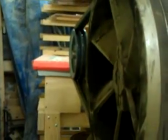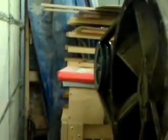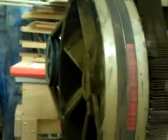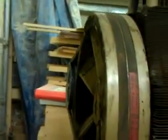And the pitch on the B section there is 6.4. So if you take the motor RPM, which is 1730, times the pitch diameter, 6.4, you come up with a weird number. Then you take that number and divide it by the pitch of the flywheel, which is like 15.65, and I think it came out with like 707 RPMs if I'm not mistaken. It's around 700, so I'm not 100% sure exactly.